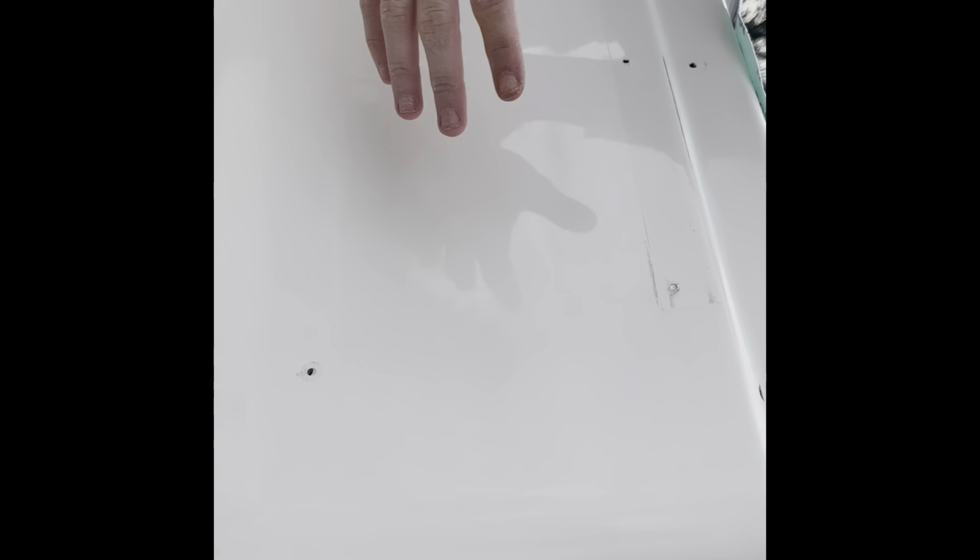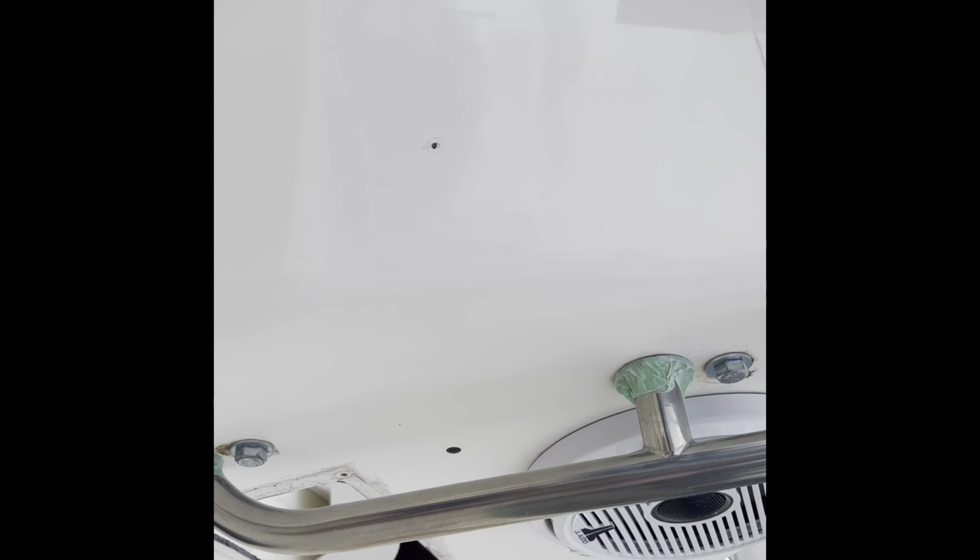From over here, from this angle over here, see, you see the trees. Yep. Here and you go down. There's nothing. So we're gonna finish up this whole entire center console. Kind of polish the clouds. Yep, you're gonna polish it. And when you put your screws back in, you wanna use some thread sealant stuff. You don't wanna just put the screws in alone. Keep water from going in there.